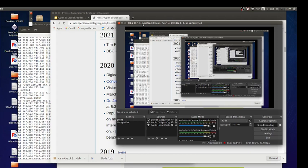And the size of the brick with the settings, that only adjusts the height of them, I imagine? Just height, because the chamber is fixed otherwise. You've got 6 by 12, so the only thing you can control is how far you go down with the main cylinder. If you go down halfway, like 4 inches, then you get 4 inches of soil, so you get a 2 inch block because it compresses 50%. You go down all the way, so you've got 8 inches, you get a brick that's 4. So that's how it works. It's just that one dimension that's controlled by the amount of material that goes into the chamber. And then when the pressure rises and the sensing happens, it turns off.